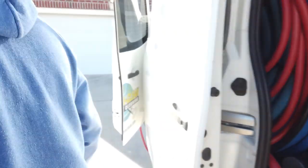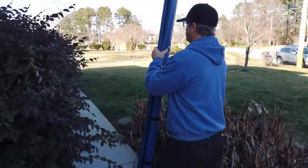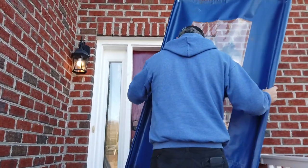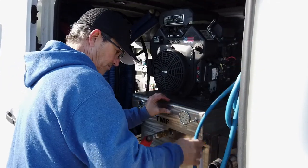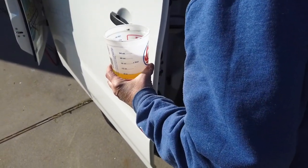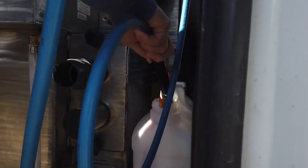I'm going to get my safety door. Why? Because you never know who might stop by — maybe a real estate agent, property management, or a prospective tenant. I want to set that positive moment of truth by putting the safety door in position. Now I'm going to fill my chemical jug on the side — I want to make sure it's completely full. I'm going to add some Formula 99, probably put eight ounces in there for two and a half gallons, filled up to about the two-gallon point. Since the machine is only in the idle position, I'll use my courtesy hose to go ahead and fill the tank to the two-and-a-half-gallon position.